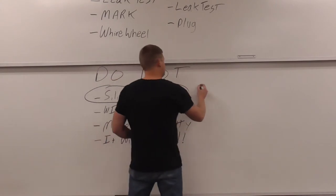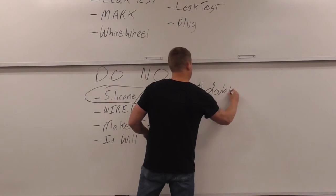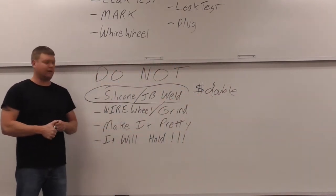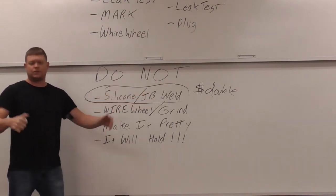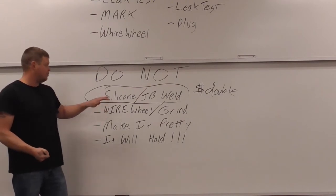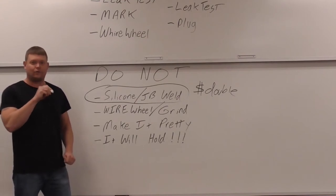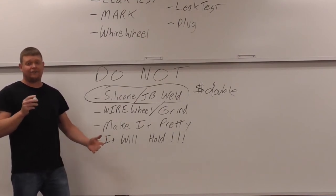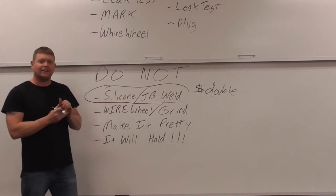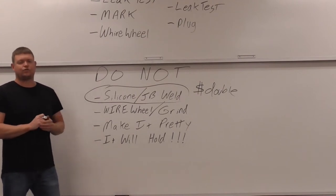But if they said they tried to fix it themselves, this is what you do. You double what you're charging right off the bat. If they said, I tried to silicone it, or I tried to put JB Weld on it, you say, well, you just doubled the price, right? Because you tried to fix it yourself. You didn't do it the right way. So when they silicone it and JB Weld it, the weld and grind takes about, I don't know, 5-6 times as long at least, because you have all that stuff in the crack. And they don't just put it on there. They jam it right in there and try and get it in the crack. And it makes it extremely hard to weld.